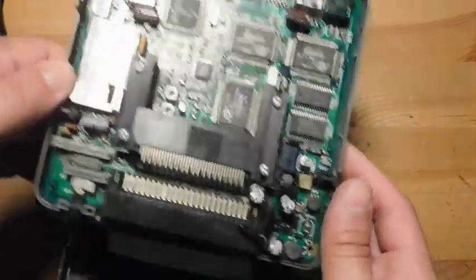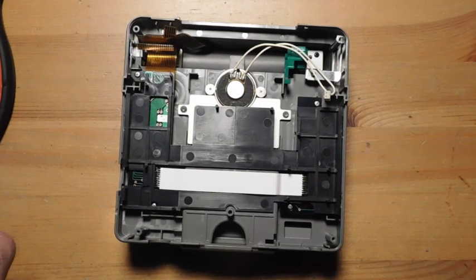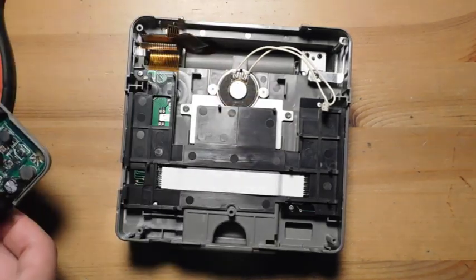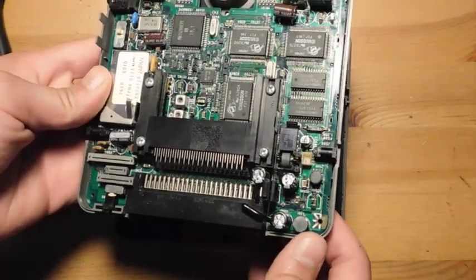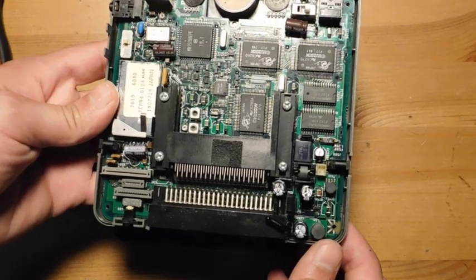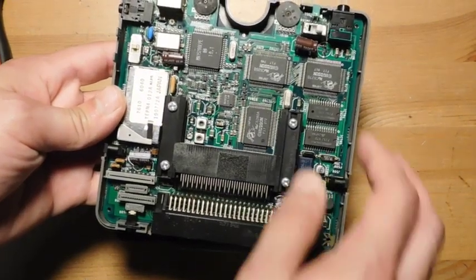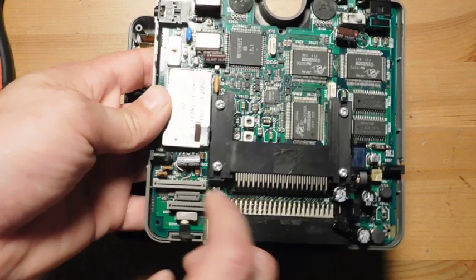So this is the PC Engine LT. My recollection is that the screen components don't have any capacitors — I'll confirm that off camera, but I'm pretty certain that part is without any caps. I can already tell somebody's been in here because there are some capacitors mounted a bit strangely. From my cursory examination, some of what was done already looks good — I can see ceramics that have replaced the electrolytics. But then I also see some things I want to take a closer look at — this is definitely strange.